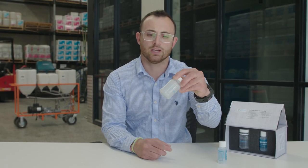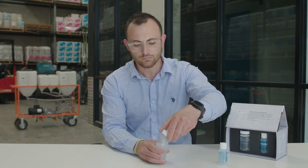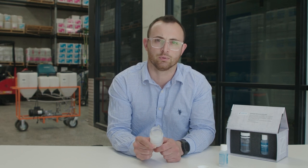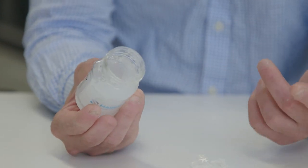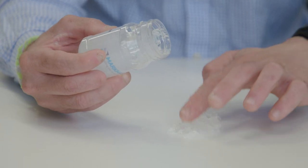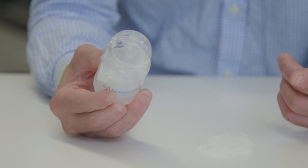As you can see, the mix has now gone off and turned into a hydrogel. This hydrogel is what reacts with the calcium silicate hydrate within your concrete matrix to densify it for the life cycle of the project and add more calcium silicate hydrate to your mix.